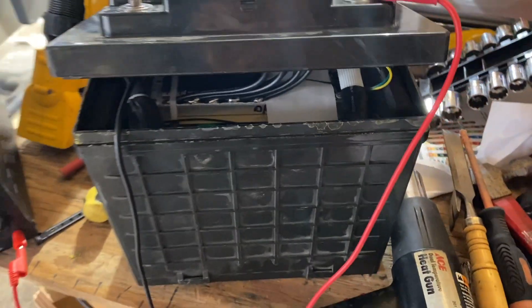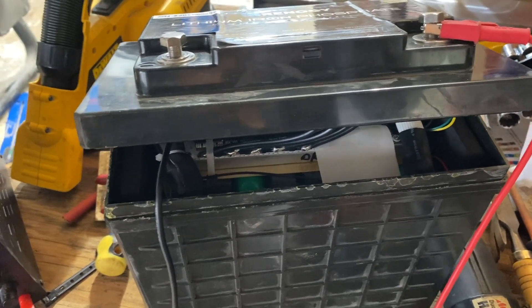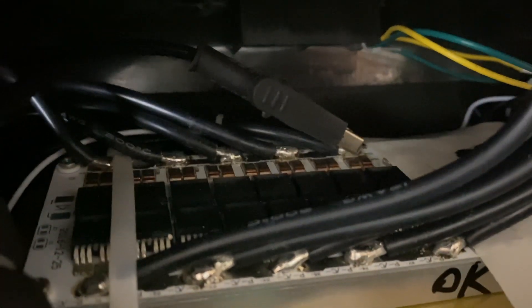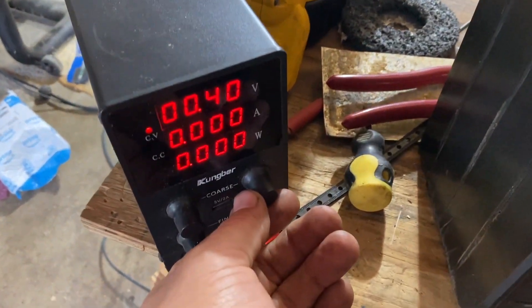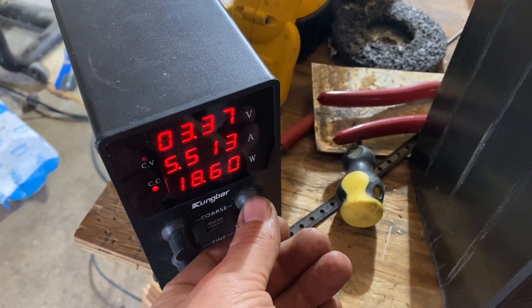The goal here is we're trying to jump it. I think something happened with this particular customer's battery — it went all the way dead and it won't come back up. That's the voltage it is currently reading: 0.4. So I went on the positive post there, and I put the other side on one of the negative MOSFETs, which is then connected directly to the battery cells. We're going to dial this up and see if we can get this thing to recover.